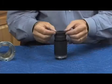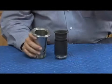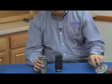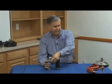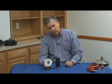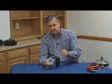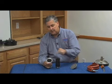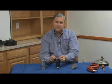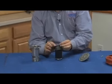Now, what you're going to do is, first of all, let's go back and talk about the body. I mentioned that O-rings only have to be hand tight. You saw that this was a 2-inch thread, and we had four very small little bolts holding that. If this was a 2-inch piece of pipe, would four bolts hold enough pressure to seal that? Of course not. That's why we know there had to be some kind of an O-ring seal. We all know O-rings have to have a slot. There's our slot. Where's our O-ring? It's molded on the back side of our rolling diaphragm.